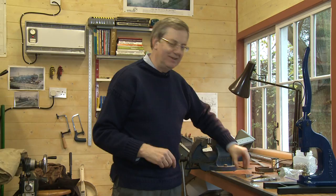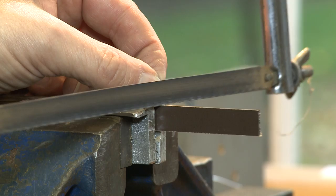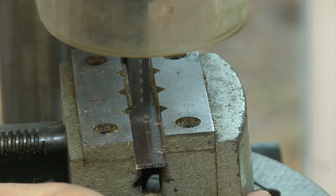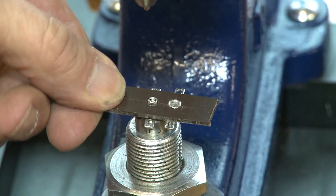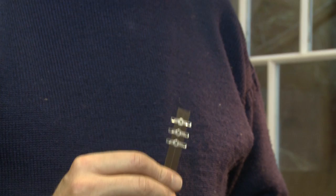Here's an example of a very small strip with three tags. Strips of plastic are cut to length, then marked up for drilling. We take the tag eyelet, push it through the hole — it's a fairly tight fit — and we use this hand punch to fold over the top. And so here we are, in a couple of minutes we've made a special tag strip.